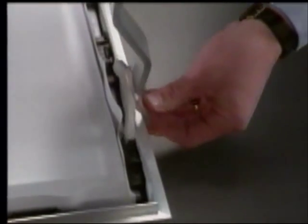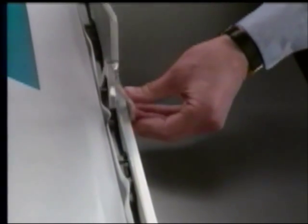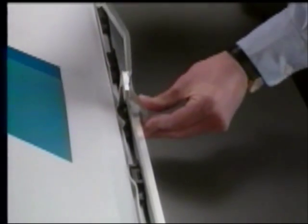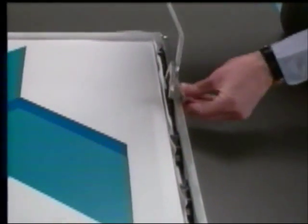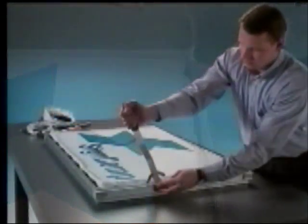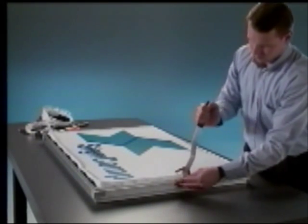You will hear a click click as the tension clip moves down into the tension channel. The clip is designed to hold at equal strength, no matter what angle or depth it is pushed into the channel. Continue by sliding the tension tool along the frame and pressing downward on each clip — slide press, working your way around the frame.